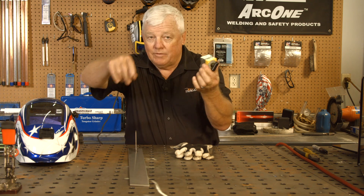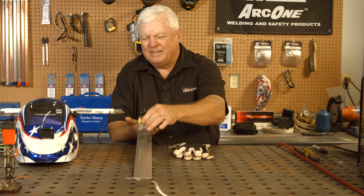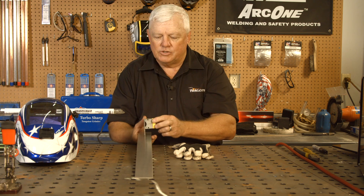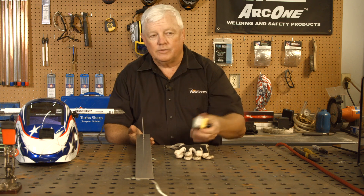So I'm going to go ahead and check — I've got a super magnet here. I'm checking it with a magnet. I don't have any magnetism. The piece that I have tacked onto it certainly is magnetic, so it definitely looks like mild steel. It's got the coating on there like mild steel.